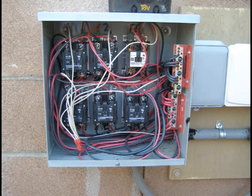One: the conduit running into the box is plastic, with no fitting to secure it to the box. It is held in place with silicone, and the locknut you see is purely cosmetic. Two: the wire fill on this conduit is somewhere around 90% — just a bit overloaded, I would say.